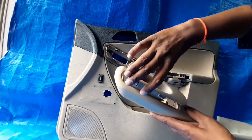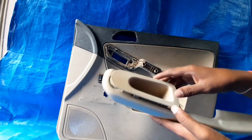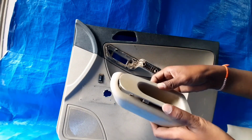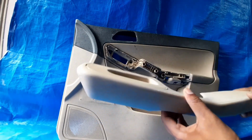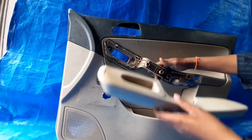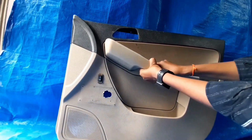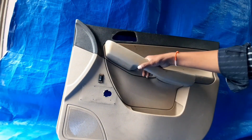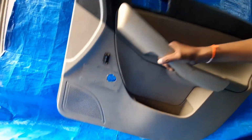So this one is a kind of poka-yoke. It is not a mirror kind of part, so both sides and edges are not similar. So you can blindly fit this one into this one like this. Now this one is completely fit. So this assembly is done completely from the A side like this. Other than this, the other assemblies are fixed from the back side.